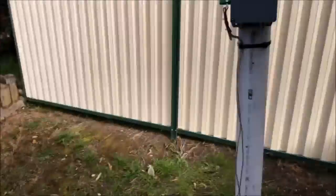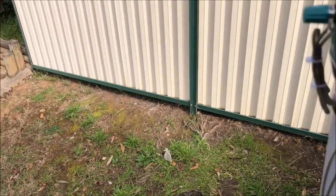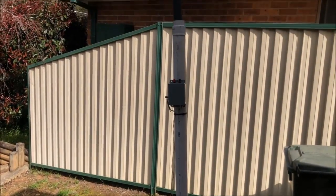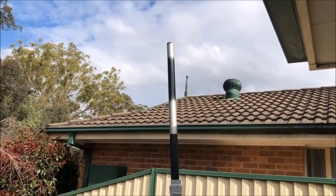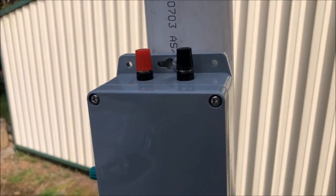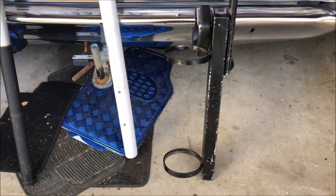There's the coupler mounted there, and then the antenna — which is a 10 meter high telescopic pole — fits in the top. So: wheel mount, a nice strong piece of PVC pipe on the bottom, intermediate pipe with the coupler mounted on it, and the antenna on top. In normal situations that would be extended to the full 10 meter length and you'd simply plug your antennas into the coupler and away you go. That's the mount for the wheel mount.